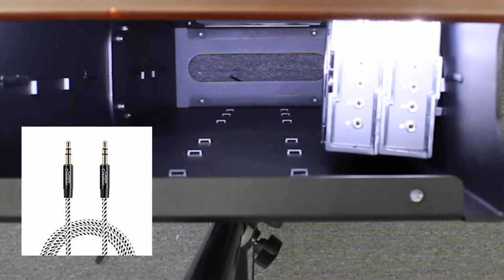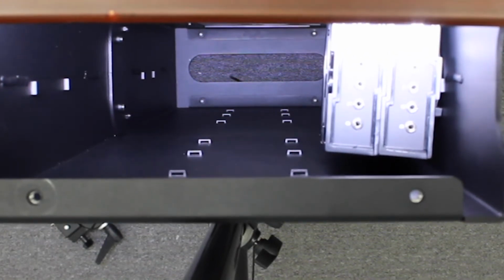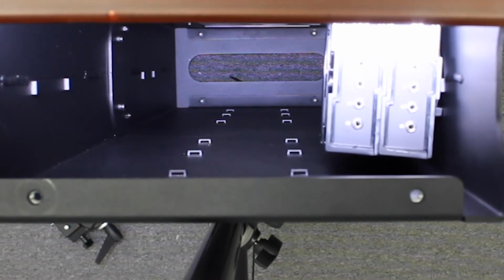And then on the second Esper box, you're going to use ports 2 and 3 to finish off the syncs to the cameras, and then port 1 is going to be used in order to daisy chain the two Esper boxes together. So it's going to go into the input port of the first Esper box, which is the one touching the left side of the booth, and then it's going to go into port 1 of the second Esper box. That's again a 3.5mm to 3.5mm end aux cord.